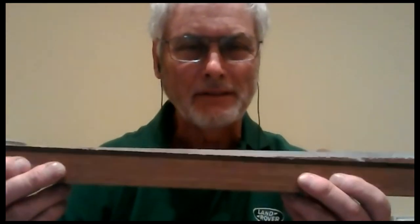Over to Roger Hardwick. Mine are the other end of the spectrum. I made these several years ago. They're made of Sapele, 27 inches long. All I did was the white is just Tipp-Ex, and the black on the front is just a black marker pen. They're hung up on a nail with no finish on them. To roughly flatten a board they work perfectly fine. I have a large planer/thicknesser, but by using these you can find, you can be more economical in flattening the board. If you just put it on a planer you can take away a lot of wood to get it flat, whereas using the winding sticks you can be a lot more careful about how you flatten it to get the most out of the wood.